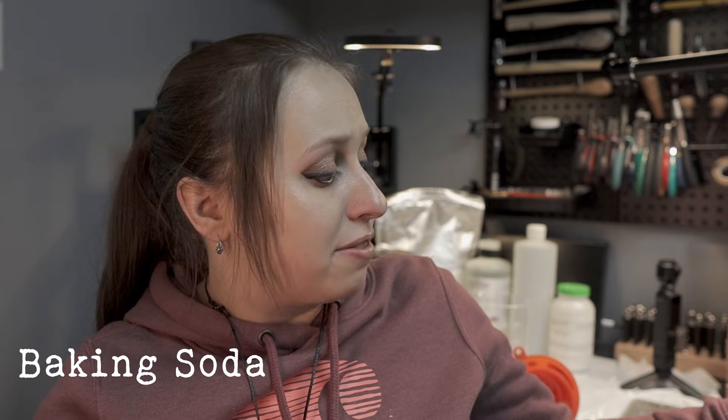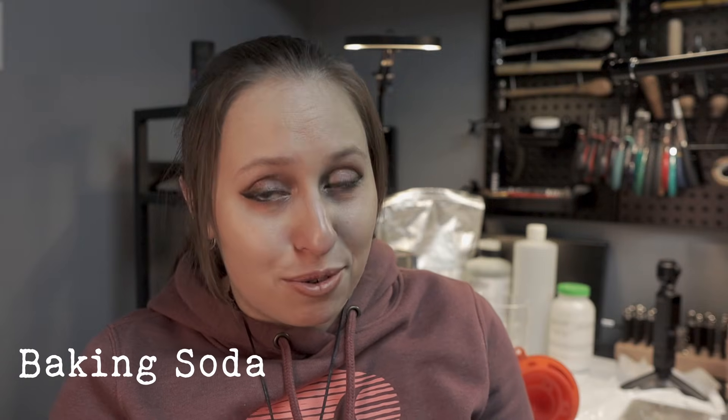I have accidentally spilled a droplet of sulfuric acid, which will eat straight through everything. Another good thing to keep on hand in case of spills is some baking soda, which is a great neutralizer if something happens to spill. That way it's easy to neutralize it, mop it up, and put it in your hazardous waste disposal.